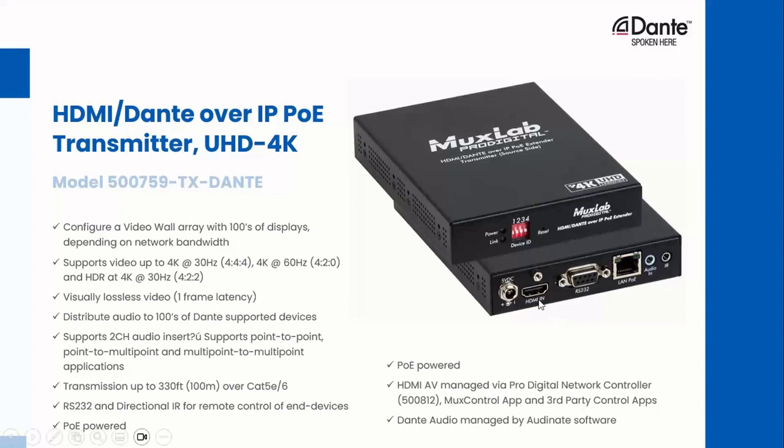How it works is it has an HDMI in, which has both audio and video. It also has a 2-channel audio embed, so you can add an additional audio channel into this device, and it'll be sent over the network and picked up by the receiver.